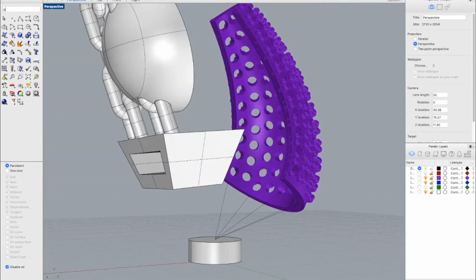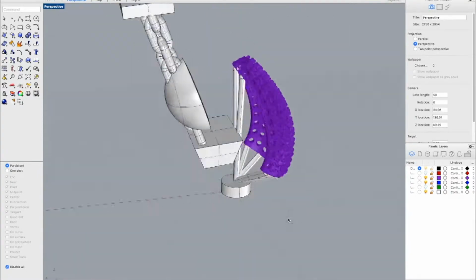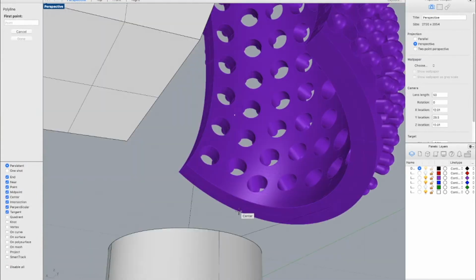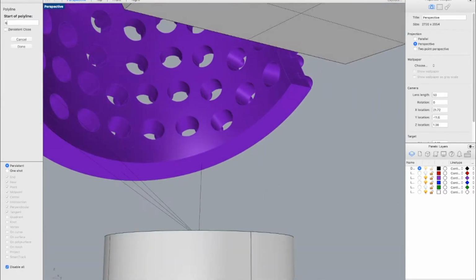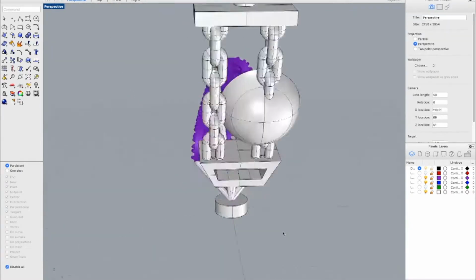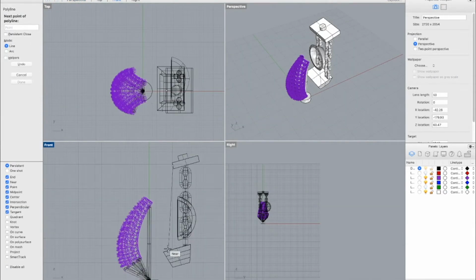In preparation for casting, I begin to sprue the pave and bale component of my piece. Sprueing is necessary to create vents in which hot liquid metal will flow into the created mold of my printed parts. I begin by isolating the parts that I plan to cast and begin to add sprues in the program using the line command to draw where I want my sprues and the pipe command to give them a 3D form. I do this because printing the object with the sprues integrated is significantly easier than adding them by hand.